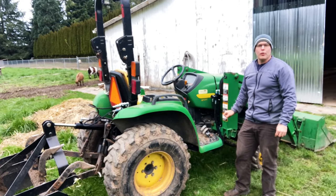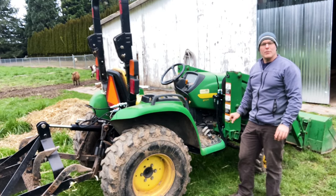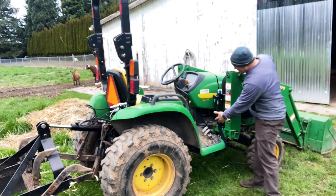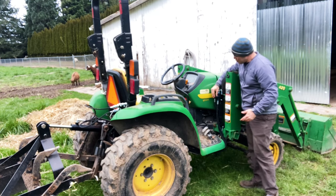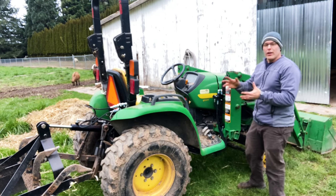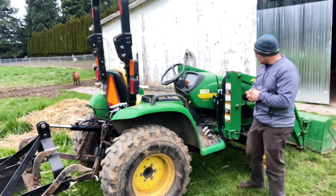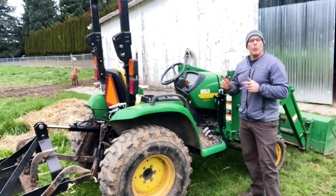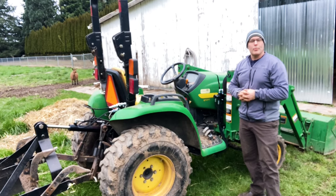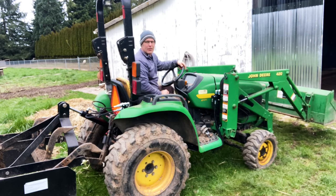Well, there you have it — the simplest and most affordable way to get a set of remote hydraulics on your tractor. Today on a John Deere 4120, but I build these kits for any tractor out there, new or old. We've got this bracket holding the switching valve here, and with a simple push or pull of this valve, you trade one of your loader functions to run that remote. Today we're running a hydraulic top link. Take a minute at the end of the video to check out my website linked right below. Also like this video and subscribe to my channel to help more people find these videos and get more out of their tractor. Let me show you how this kit works.